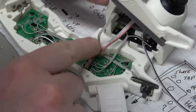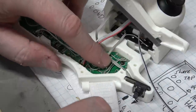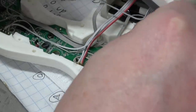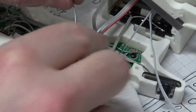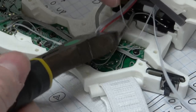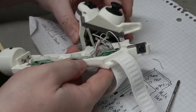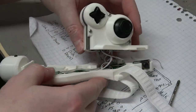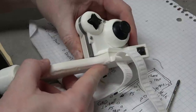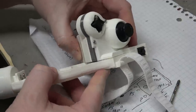All right, let's finish up the wiring. Actually, yeah, aside from the USB port, this is the last of it. Or the last of us. I think I'll actually strip this a good ways back and then have a little bit of slack on my wires. That'll make them easy to fold back up inside the unit. All right, that's everything in the module hooked up. Let's see if it still fits. If I fits, I sits.